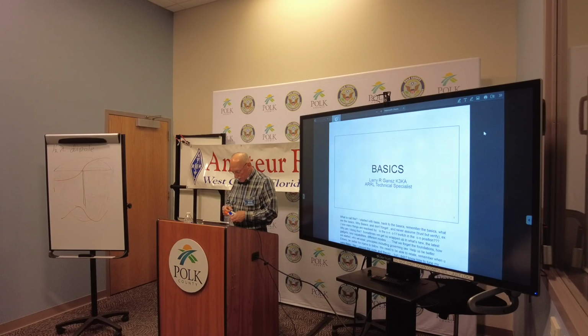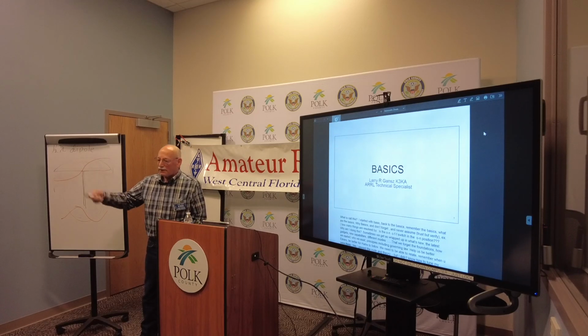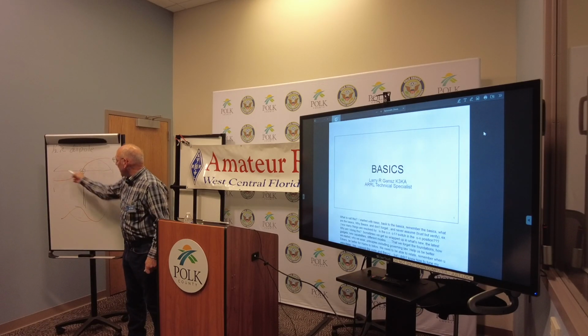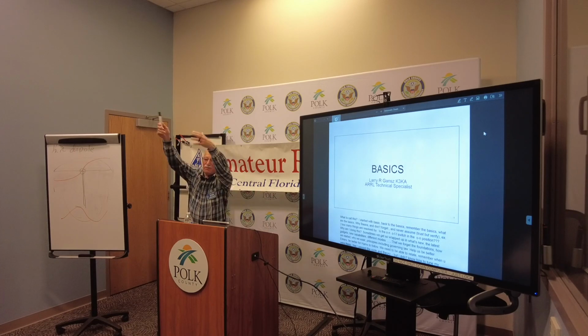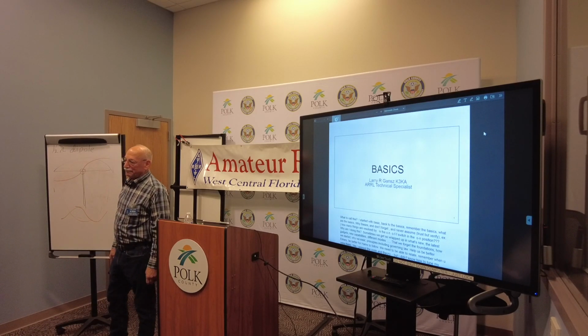Okay, before we get there, a couple more questions about this half-wave dipole. And half-wave is relative to frequency, okay? So it's at resonance. What's the input impedance of this half-wave dipole antenna at resonance? Technically it's 72 ohms, but for our use it's 50 ohms. So somewhere in there, right? And what do you often feed this with? 50 ohm cable, so you automatically get a small bump in mismatch.